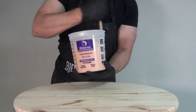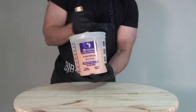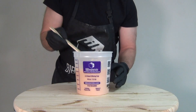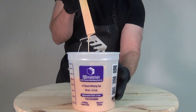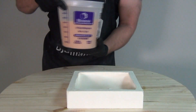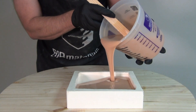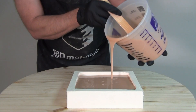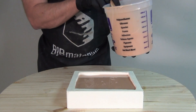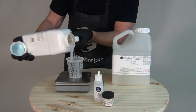For this part I poured it in an afternoon and let it sit overnight — a good 12 hours or so before demolding the finished part. As you can see it's almost water thin, so I didn't even vacuum degas this batch. Because of that slow working time it's going to have a lot of time to de-air naturally on its own.